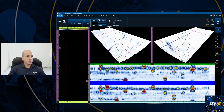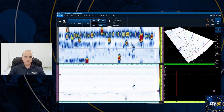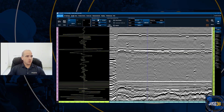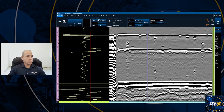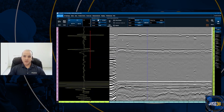I'm going to toggle single display and look at an ABCS view. We now also have the ability to export C-scan data along with the A-scan data from our B-scans. On the TOF side, we've added a gate, so you can now utilize gate A for readings as well as amplitude adjustments. In the OmniPC tab, we can use an auto percentage adjustment for amplitude on TOF, as well as what we had before on phased array.